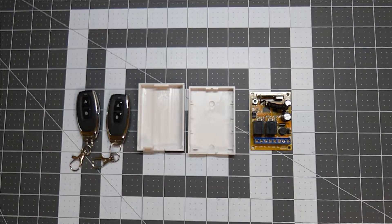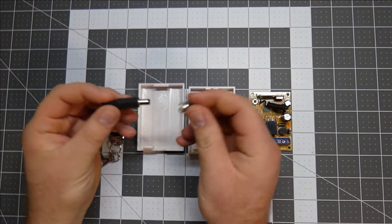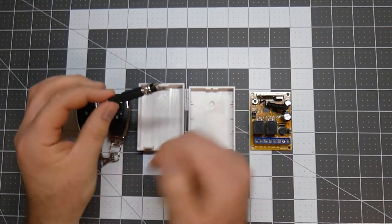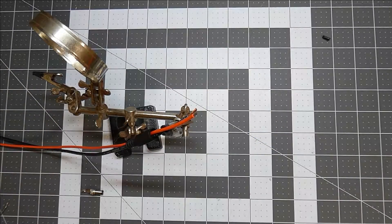It's cold outside, so I'd like to do as much of the wiring on my workbench as possible. This relay module does draw a small amount of current when not in use, so I'd like to be able to disconnect the power from it. To do this, I'm going to use this 2.5mm power connector, as I don't have a toggle switch on hand. The first thing I'm going to do is build the plug used to supply 12 volts and ground to the relay module.